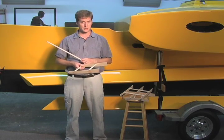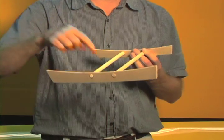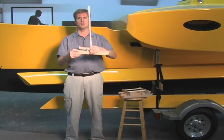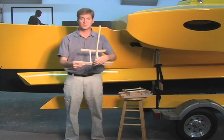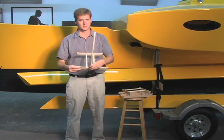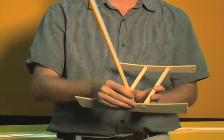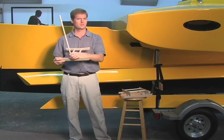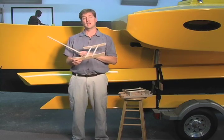That's why I'm interested in proas. Let me reel off the advantages. First of all, you get trimaran and catamaran-like stability and speed. You only have to build one big hull and one little hull — it costs less and it takes less time. Second, with the rig mounted in the big hull, dynamic loads on the crossbeams are much lower. Instead of pressing a hull harder and harder into the waves as the wind gets stronger, the little hull lifts out. The stresses are nicely balanced between the mast, crossbeams, and shrouds, and the proa accelerates rather than disintegrating. Third, it's been suggested that one reason westernized proas are so close-winded is that they have a remarkably easy motion under sail. Because they're essentially stabilized monohulls, you don't have that jerky motion going through waves that catamaran and trimaran sailors talk about. This keeps the flow attached to the sails, keeps the speed up, and keeps the crew comfortable — at least as comfortable as you can be at 15 knots or more.